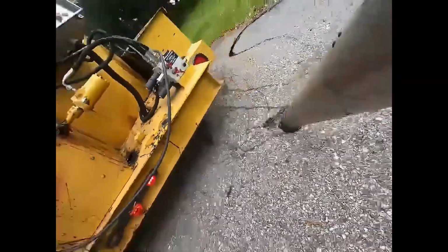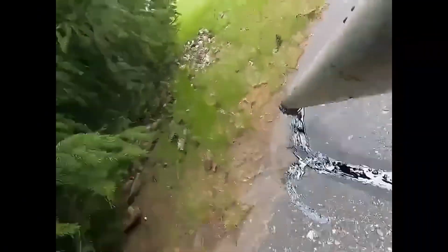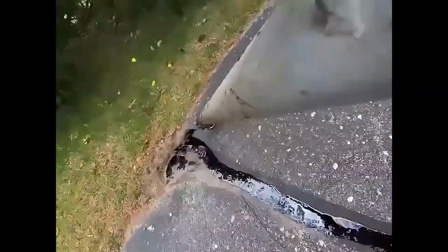It's a non-stop flow of rubber, and you can really get in a groove getting the major areas done that look really bad. If you're not trying to make a good showing, and they say, hey man, I'm not going to be able to get it all, I can only afford about 10,000 linear feet this year, well then just use the Cam 10 and some pour pots, and you can fly with that a lot quicker than trying to move this truck and trailer around just for some quick linear runs, you know what I mean? So there's the right tool for the right job in this instance.